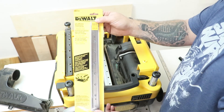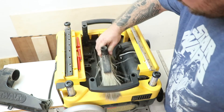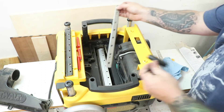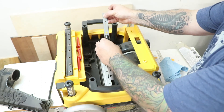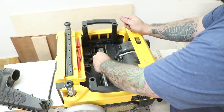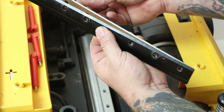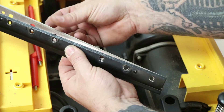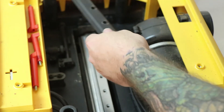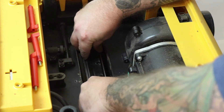Here are the factory replacement knives I'm going to install. Before installing the new blades, I'll make sure that the cutter head is clean of any sawdust or debris. I use the T-handle wrench provided to also install the new blade. The blade has two slotted holes that have to fit over alignment pins in the cutter head. Now I'm ready to reinstall the clamp, making sure to align the beveled edge of the clamp with the cutting edge of the blade when I install it to the cutter head.